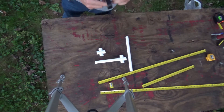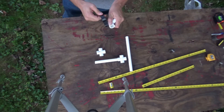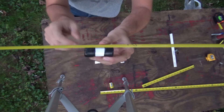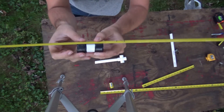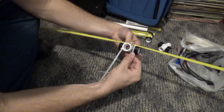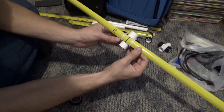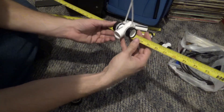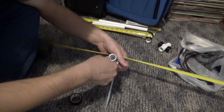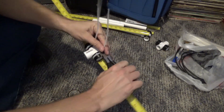Next, prepare the PVC tee and two crosses with about 20 winds of vinyl electrical tape per side — two opposing sides on the crosses, and the tee should be self-explanatory. This helps the tape measure elements lie properly across the joints without bending inward, as the crosses and tee are not necessarily flat, even with the curvature of the measuring tape. Center the reflector element on one of the crosses and prepare your zip ties by forming each into a large loop. Slide the ties over each side and pull them tight against the joint, making sure the element remains centered as you pull them as tight as you can. Once you're sure the zip ties are tight enough, clip the excess part off.